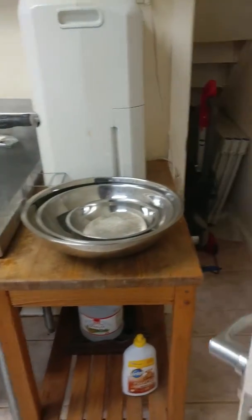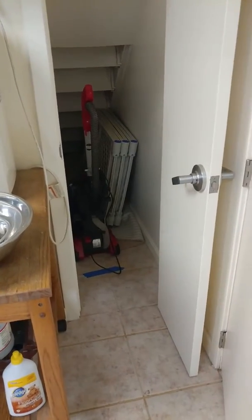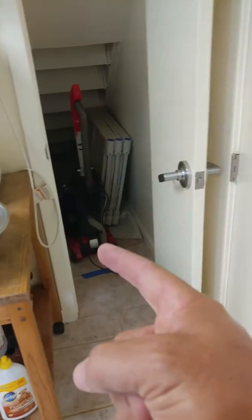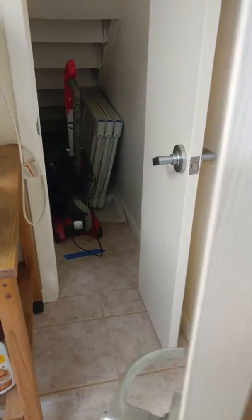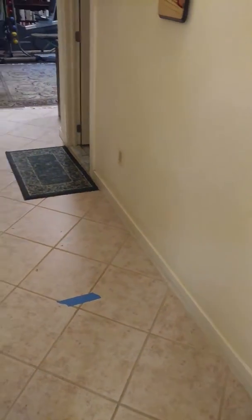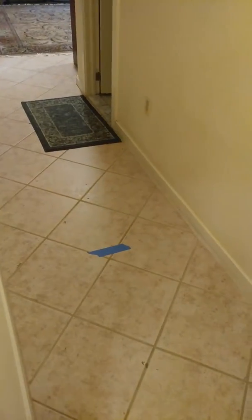The roots come to just this side of the wall, really just underneath. We need to jackhammer in here — I want to take it out from that side of the closet over there because there's no sense in ever having to touch that closet floor again. Underneath the wall and to this side of the wall right here, replace all that pipe — about six or seven feet of pipe. It's kind of a small area that we're gonna be working in.